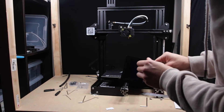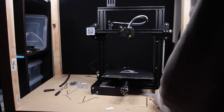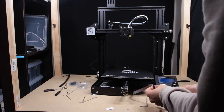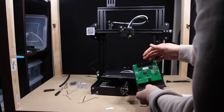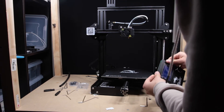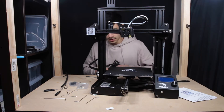When it comes to the screen and the control knob, you have to plug it in with the wire that comes from the main board — they tell you to screw it on. Then later they tell you to connect it to EXP3. There are three ports, and when it's at that angle you can't tell what's what. For reference, for anyone who doesn't want to unscrew theirs: it's the port closest to the hotbed.